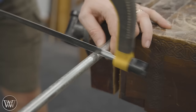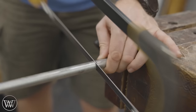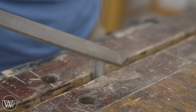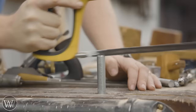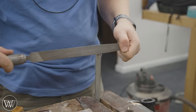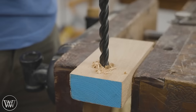For the net, historically these were put on with plastic spindly things, and we want this to be durable — the camp almost always broke those off. So in this case I'm grabbing a 5/8" steel rod and we're going to put this through that tenon, and this is what the net will hang on. Basically if a camper happens to break it, they will probably have broken themselves first. One end we're going to round over a little bit because it's going to go through the end of the rod. The other end we're actually going to cut a slight slit in the top. I'm going to start with a square file to cut a notch in here, then bring in the hacksaw and cut down a little ways. This is going to let the tensioning string slide into it and allow you to tension the top of the net. I need to round it over a little bit so the string can round the end and come down in. I can use a needle file to clean it out just a little bit so nothing's going to be snagging on the string.